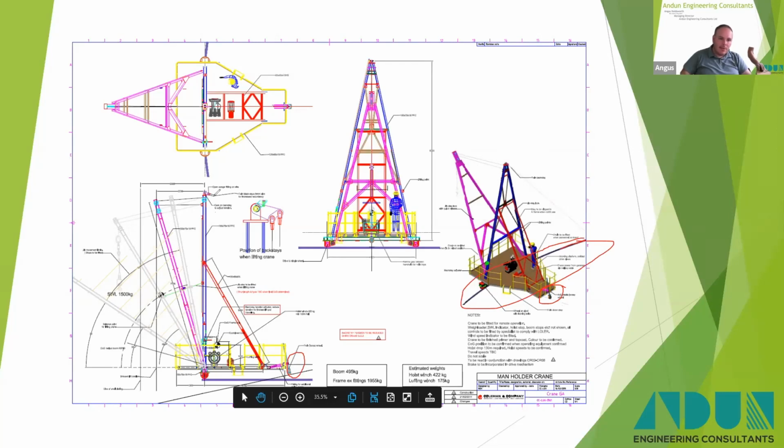When they're lifting, they have what we call the backstay up here, and this goes back to the central pivot in the middle of the holder itself. So the tension load goes back there, and then we can lift from right in close all the way out to allow us to drop the panels down to ground level. So this was, say, the first iteration that was designed, and they developed over the years to be able to lift heavier loads at a greater radius.